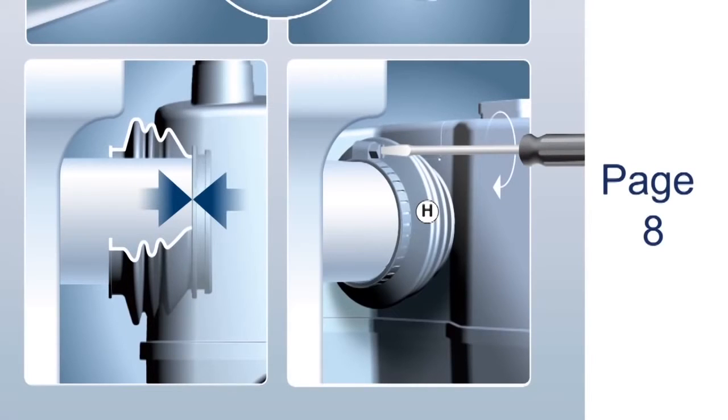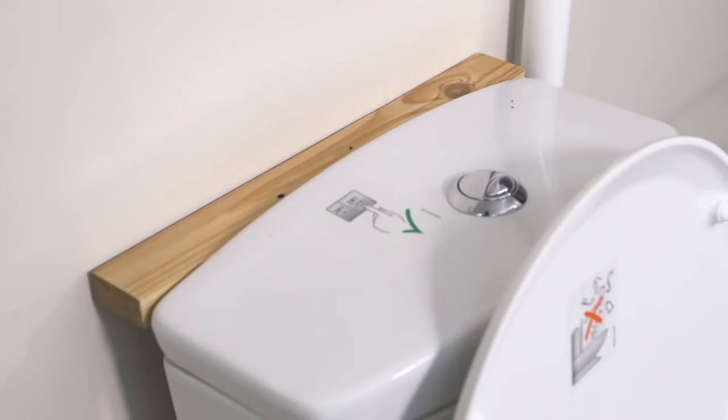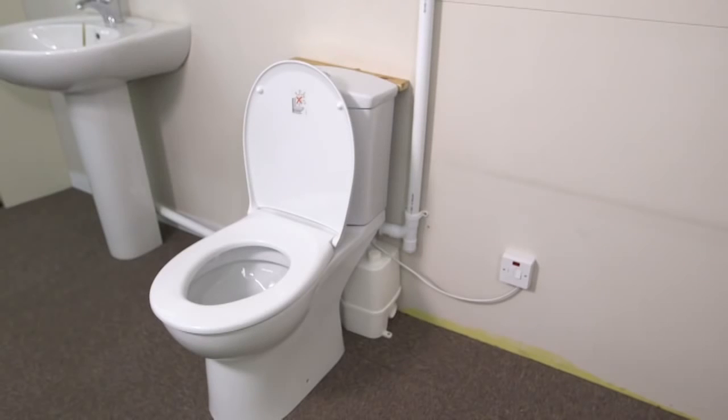Pull the pan outlet over the outlet pipe of the toilet pan and secure with a Jubilee clip. When the toilet pan is installed with the Sololift2, there may be a gap behind the cistern. If required, put a batten behind the cistern to help support it. Apply the user reminder stickers so they remain visible for the user. Fix the WC to the floor.